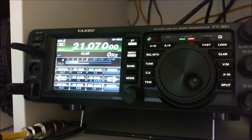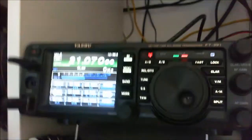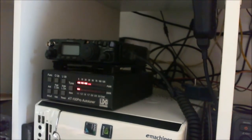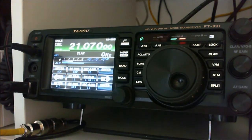If I click the radio into transmit so that I'm transmitting a signal, you'll see that my ALC doesn't move on the radio — that's this section here. If you look at the ATU it'll show you that I'm putting out 30 watts on 15 meters with no ALC at all. The ALC you see now is actually the receive signal coming in, because obviously I'm receiving, not transmitting.